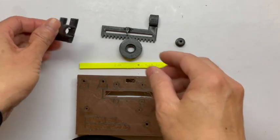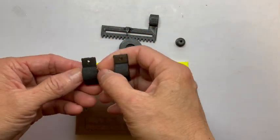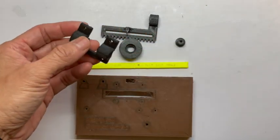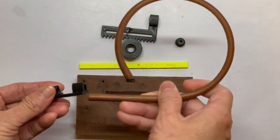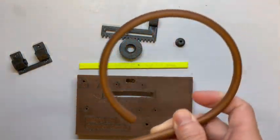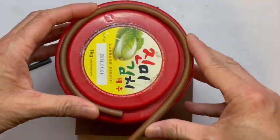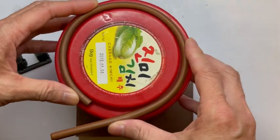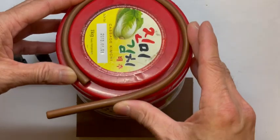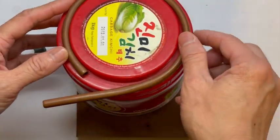I've completed and printed all the 3D printable parts for this FM crystal radio. This is the mount where we have the coil. This coil can be made by bending a piece of 8 millimeter wide soft copper pipe — the type used in air conditioners — bent against a 100 millimeter diameter fixture so you can build this shape with a small tail at the end.